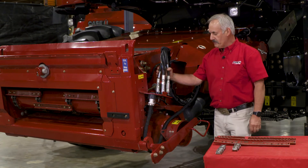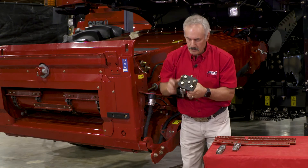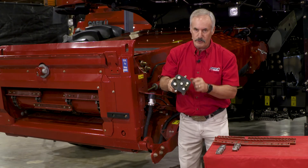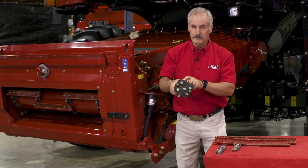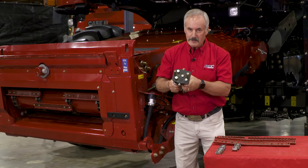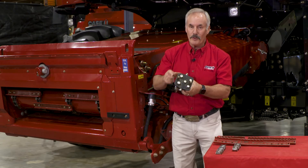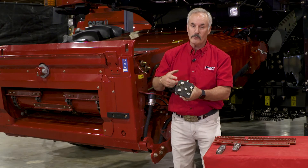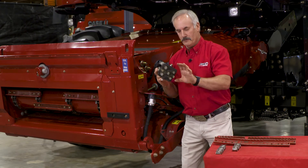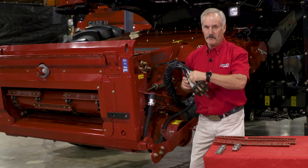A couple of other things to make sure you don't run into issues during the season: if you pull out this coupler and look at it, these should all be flush. If they're recessed, that means there is debris inside the couplers, so you need to take them apart and clean them. Sometimes there's an o-ring that's flipped over and they'll end up leaking. More importantly, if the coupler is not opening properly, it'll cause overheating in the hydraulic system — that's the part you don't want. Have a quick inspection on these and the plate on the header itself. If you don't see them flush, fix it before you go to the field.